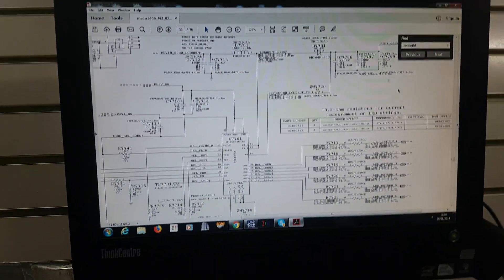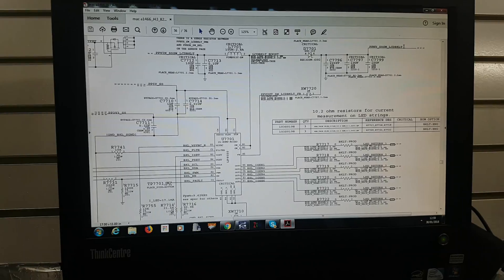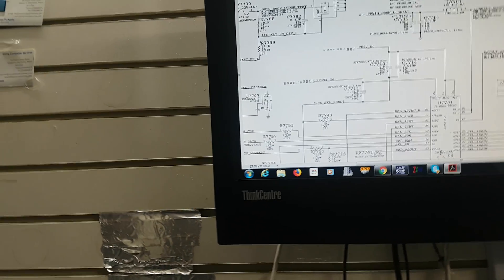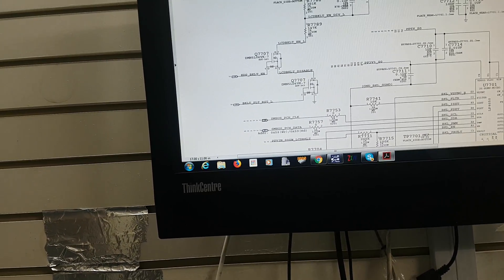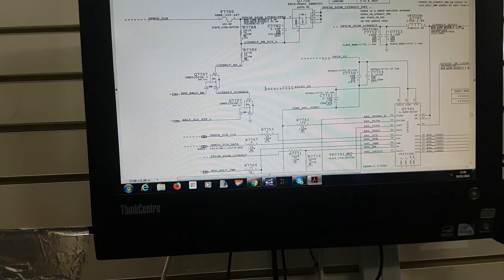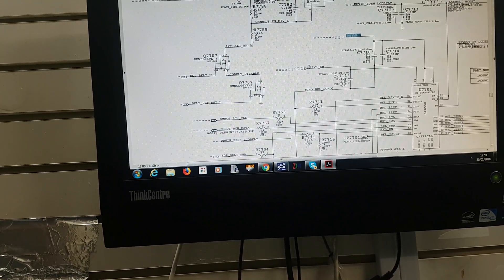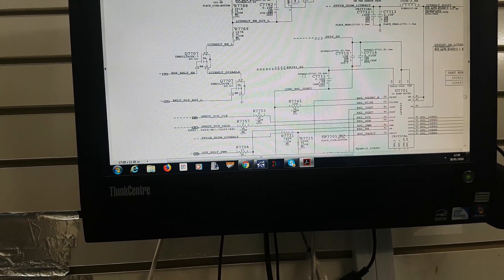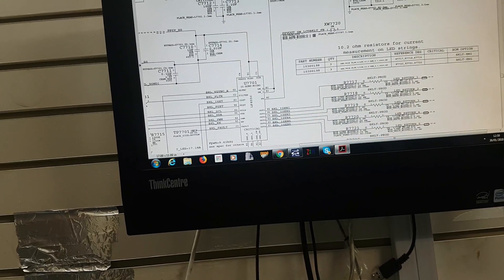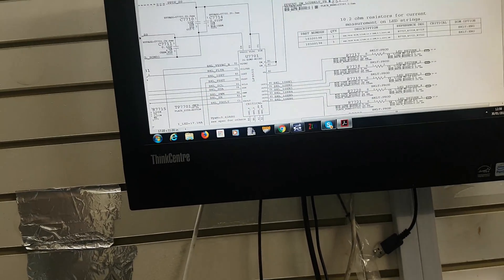Let me show you what we have here. We checked the S0 switch, LCD backlight, and all the inputs — for example, the PP bus G3 hot was present, but there was no boost circuit. For the boost circuit to work, it needs inputs which are 5V S0 and 3.3V S0, and all of these were present, but still the boost circuit wasn't working.